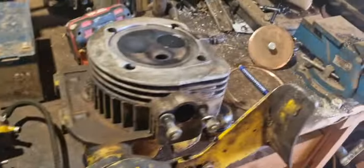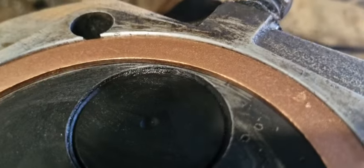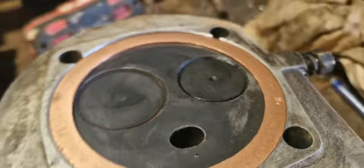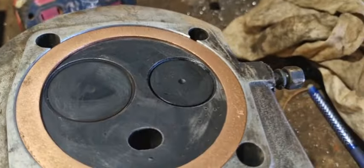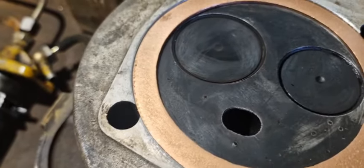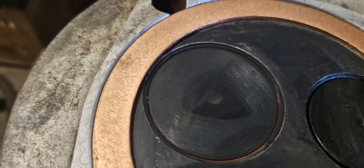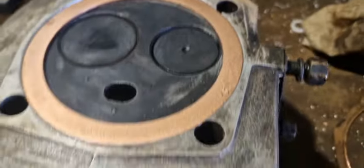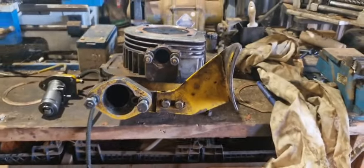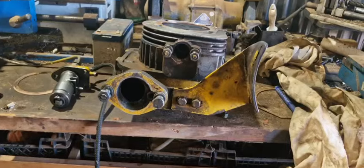But hey, let's throw it on and see how it looks. As you can see now, this is perfectly aligned with the gap for the exhaust valve. Otherwise it will hang over there and I don't like that. On the other hand, it makes another edge at the cylinder of about 1 millimeter, but whatever, you have to do some trade-offs for such things. One last look inside the... oh no, my light's not working. Let's throw it back together.